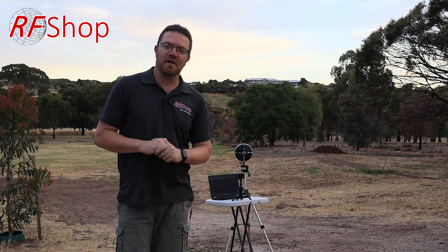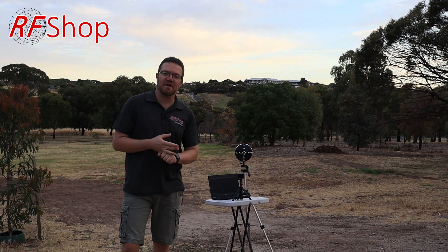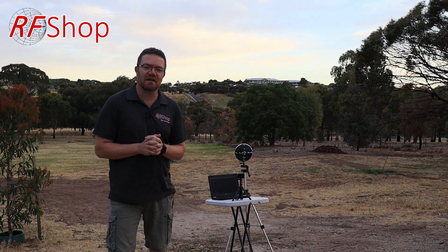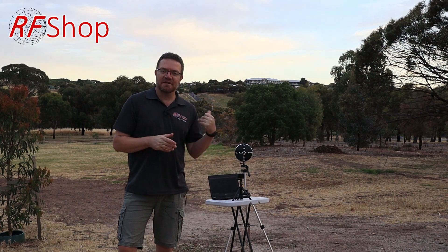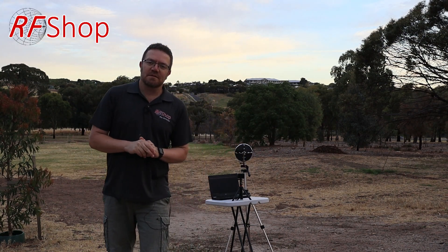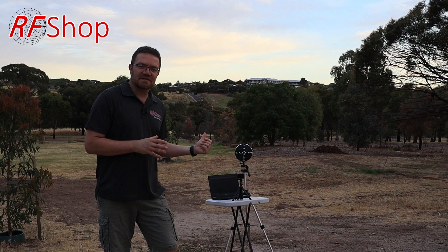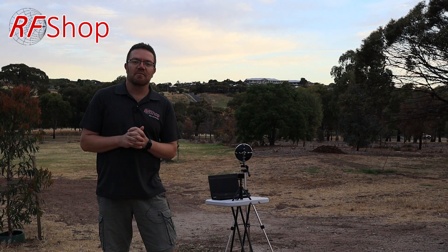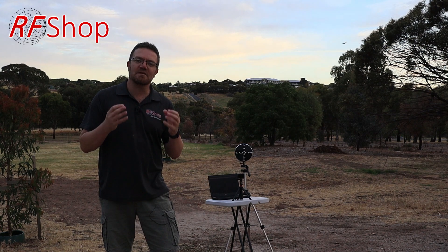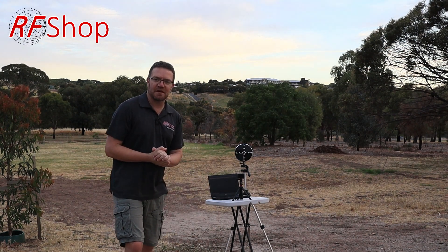Thanks for watching. I am on fire to get the rest of this antenna working. This antenna works for Wi-Fi right now, and it actually works from about 2.2 GHz up to 7.2 GHz — it even goes to 8 GHz — but I'm using it for Wi-Fi because this is what I can prove and demonstrate. The antenna works for any application in that frequency band. The concept of 3D printed antennas is just growing and going to grow from strength to strength — phenomenal potential for drone-mounted technologies and beyond. Thanks for watching. Cheers!